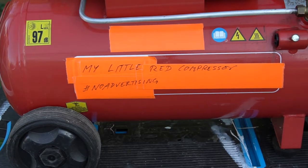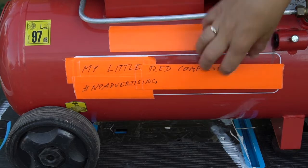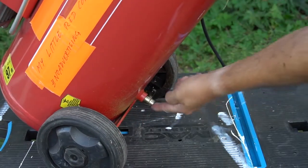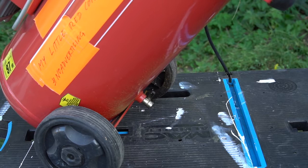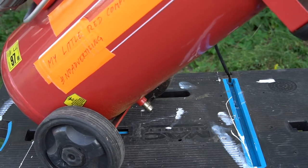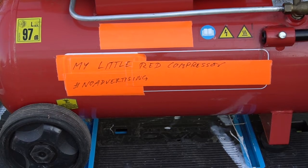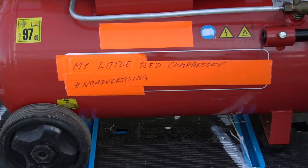Now we are coming to a really important part — the air tank. The air tank is a welded steel tank. When your compressor is working, it's pulling all the air around you inside and compressing it to this tank. It's not only air, it's also humidity. So if the compressor is working and working, you should from time to time drain your air tank because it's full of water. We have here a small ball valve — open it, you can do it pressurized or depressurized. I do it always pressurized, I put safety glasses on and maybe a hose to drain it nicely. Because it's not only water, it can also be a couple drops of oil and rust, because there's a blank tank inside that's rusting. So it's so important to drain the tank from time to time — the more often you drain it, the less the tank will rust inside.